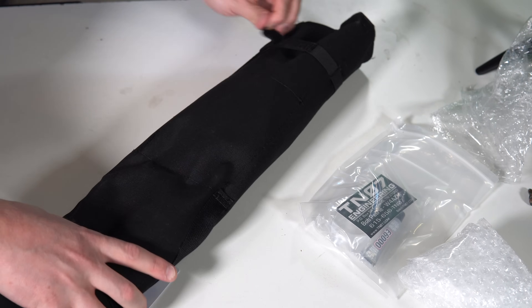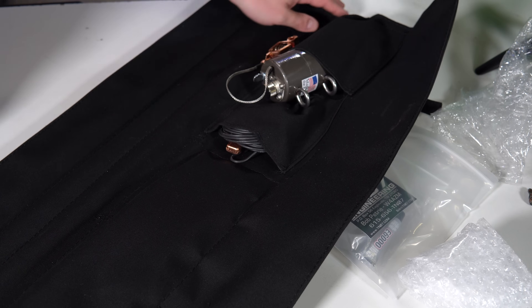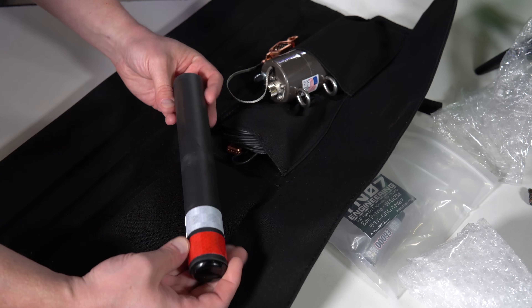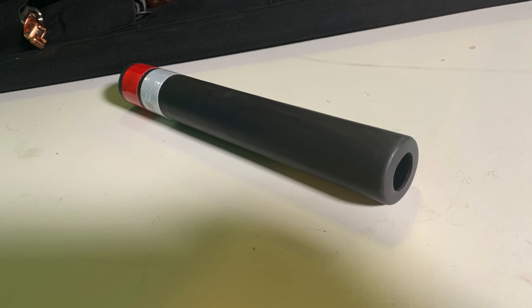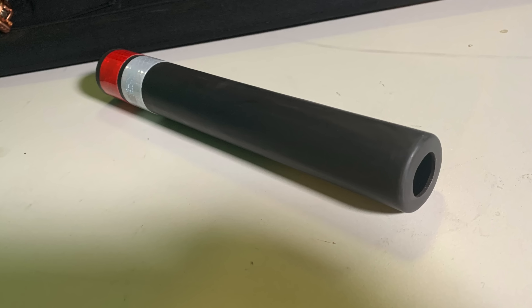2:1 SWR is totally fine for your base station or QRP radio to go portable or run at home. The bag it comes in is handy and everything fits well. However, this antenna is about 10 pounds, which puts it in the POTA portable space and definitely the home antenna space — I wouldn't put it on my back for a solo hike. Those ground rods need to be driven in about eight inches, and it does come with a post driver, which adds to the weight.